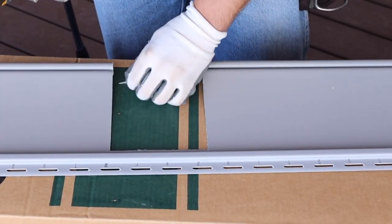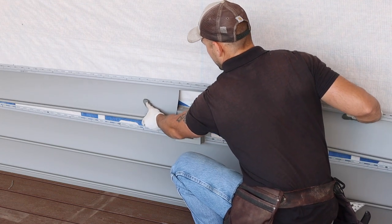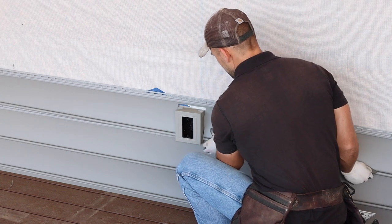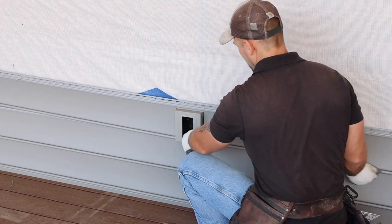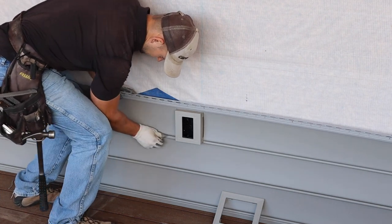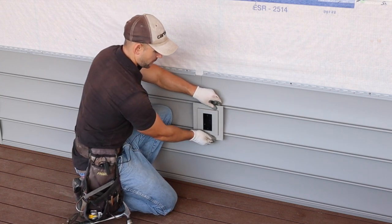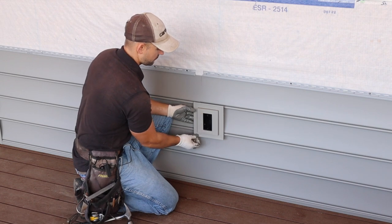We got that cut out nicely. Go ahead and place the siding around the E-block — slide it around like that, looks like a nice cutout — and snap it into place. You can start around the E-block or start on the edge of the siding, whichever you prefer. After you've got the siding around the E-block, take the trim and place it around the E-block and snap it into place. That gives you a good finished look around your outlet.